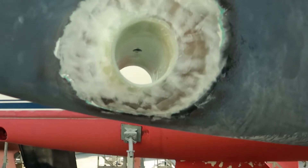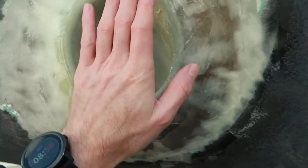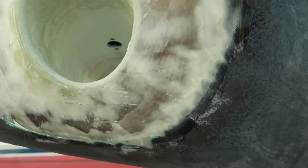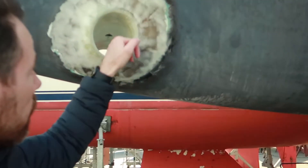It is an absolutely beautiful morning down here at the marina - no wind, sun, about 10 degrees. This is where I left off yesterday. I ended with the second layer of fairing. I'm just going to sand it down and hopefully this is going to be the last layer of fairing I need. After sanding, I will install the gear leg permanently in the tunnel with the motor bracket inside.